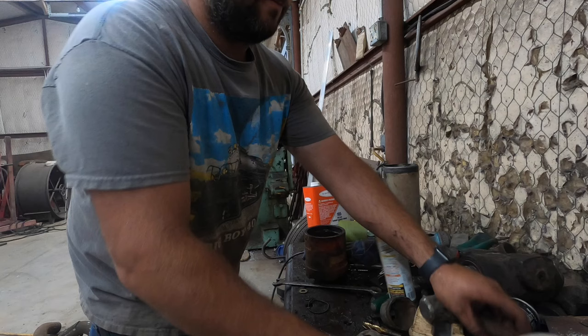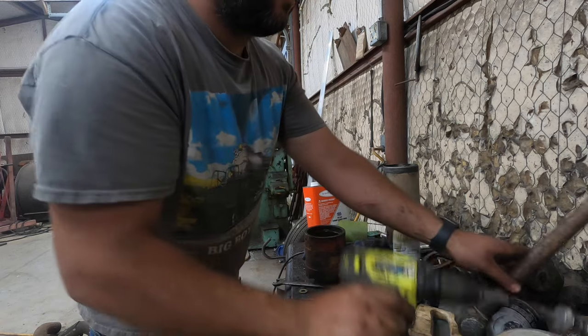So I'm fixing to drive the bushing in this housing for the saddle bearing, and I was just explaining in the part I lost that the fire leaves some sort of rough residue on the inside of these bores, and you need to take some sandpaper and clean it up. I've got a cheap Harbor Freight hone to put on a drill and run through all these, and it's just a nice conforming sanding mechanism that cleans them up, makes them real smooth, and takes the bushing easily.